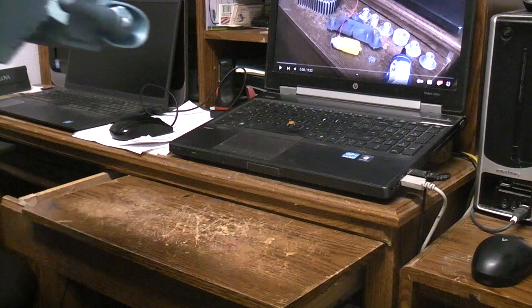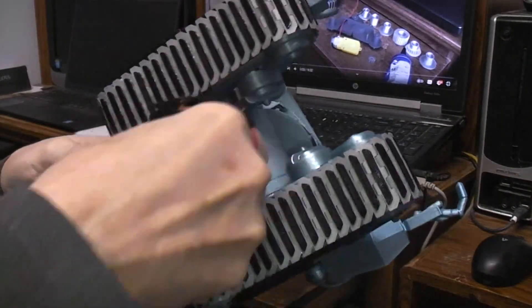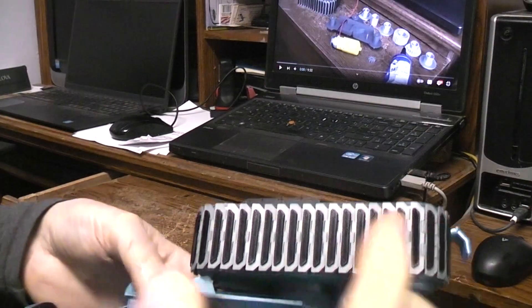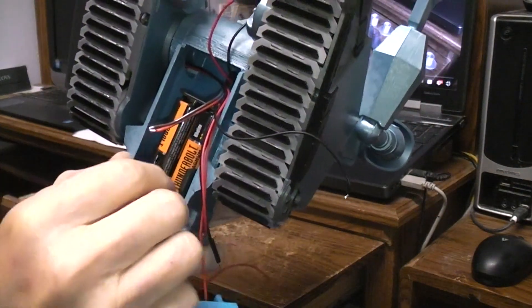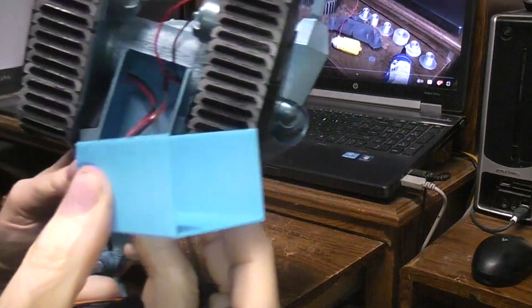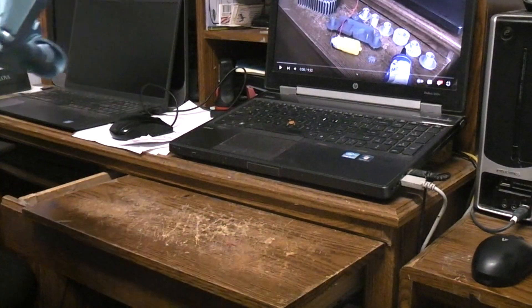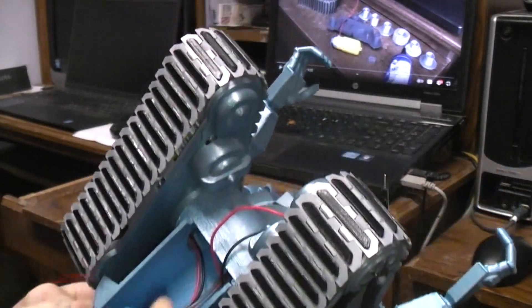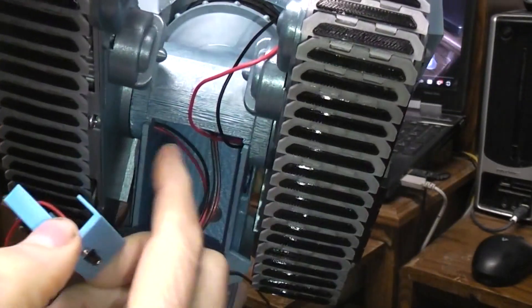As far as the battery pack goes, I'm still leaning towards six volts — four AA batteries. I put two magnets in there and the magnet should stick to the battery pack and hold it in place. When there are no batteries and the thing is on display, I don't want the pack just hanging down, so there is a cover piece that friction fits in there and covers it all up. There's also a piece with a switch from the battery pack, which I'm envisioning going up towards the front and bottom — pushed all the way in so the switch would be on the bottom.